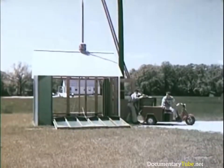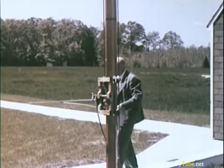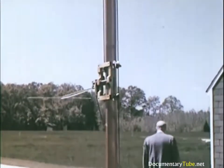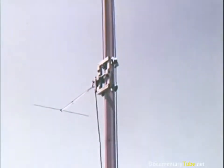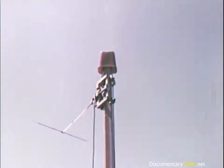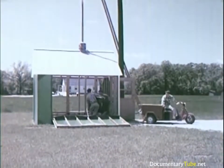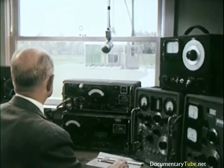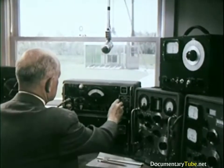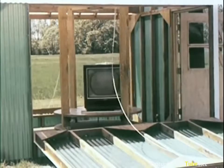It has long been known that an instrument such as a television receiver could, if not properly shielded, produce picture interference in other nearby sets due to signals being fed back into the air by the receiver. Engineering models and prototypes of sets are brought to this laboratory and checked, developing circuits that keep such interference well within the required limits. Special equipment is used that can measure signal field strength in terms of millionths of volts. They actually use these to develop sets with built-in quality, long before FCC requirements were enacted as a law.